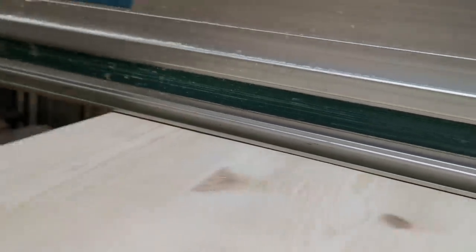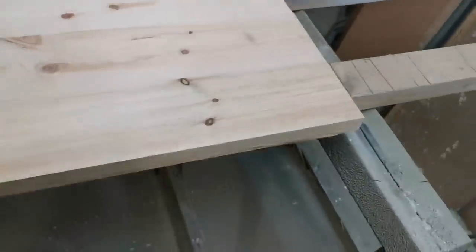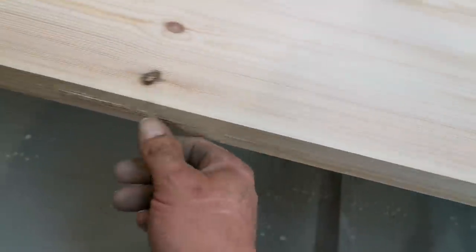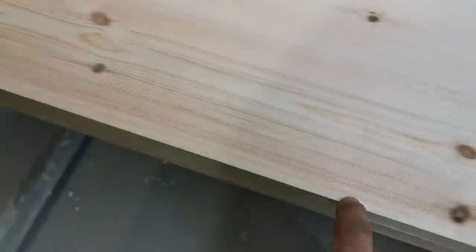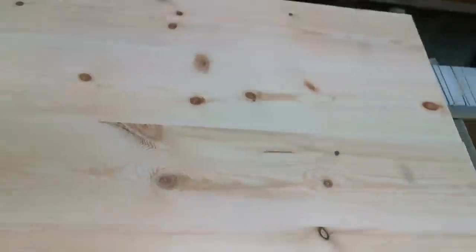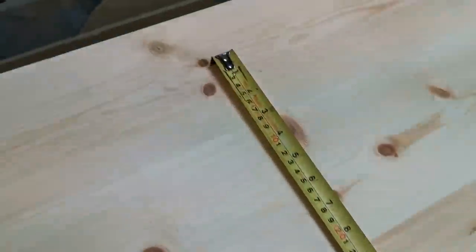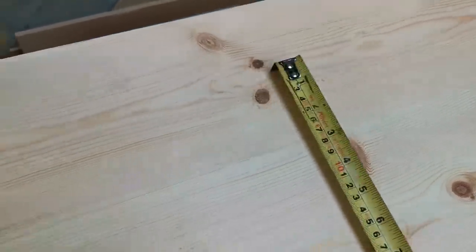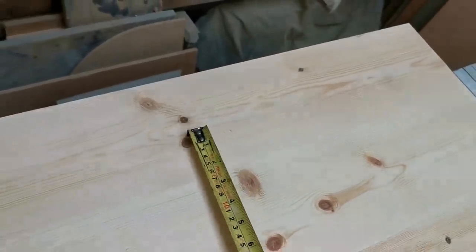See, boards are pretty flat. This one is anyway. And this other one, apart from the bits of ply from the packers, I got some glue on my fingers and then it was on the packers when I clamped them together. But it's a clean edge that, so I'll just take off just enough to clean it up. And then 500mm will give me to there. So I should just come inside that knot. Oh, in my luck, I'll expose some crap in there, but I'll put that to the back.